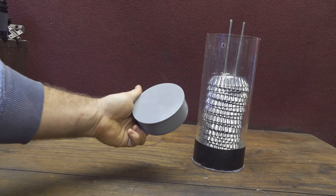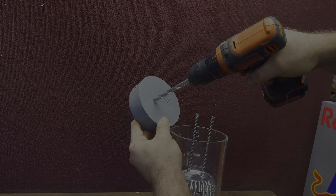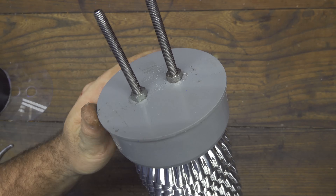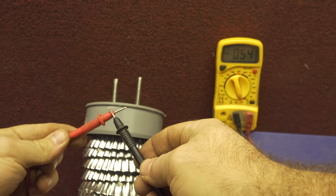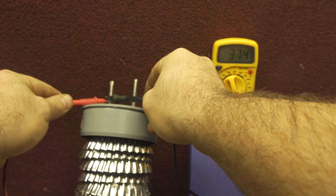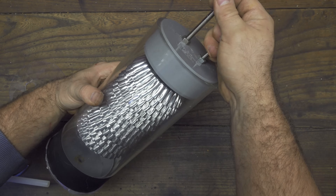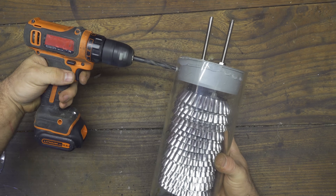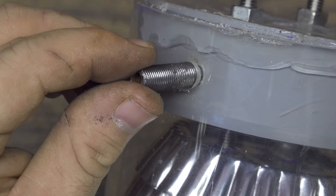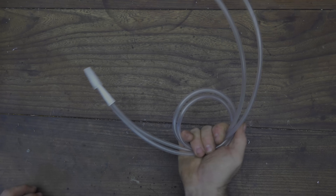A plastic container is used to hold the water. A cap is very important to seal the top, and I make two holes so I can insert the two stainless steel electrodes. I put some nuts on the threaded bars, then insert the cap and secure it on top with two more nuts. I use a tester to make sure the two electrodes and all the plates don't touch each other — it only beeps when there is a short circuit. I also make a hole on the side to collect hydrogen and oxygen, and a little tube is secured and sealed in place with super glue.